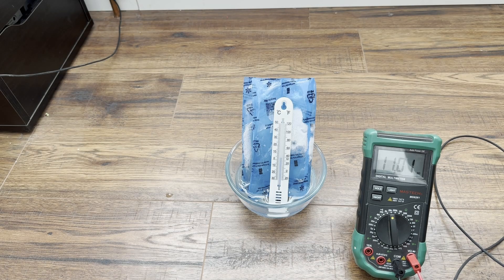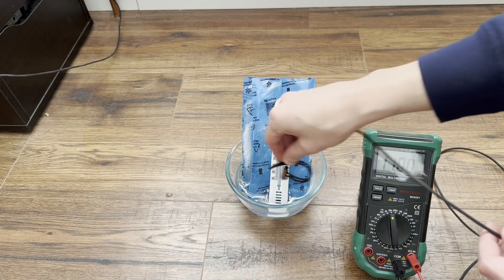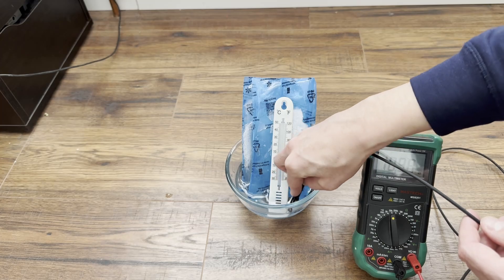Getting them up to that desired accuracy took a few passes and I'll talk you through those now. I started by checking that the NTC probes were actually outputting the expected resistance, and I accomplished that by using an ice bath and an actual thermometer. Once I was happy that the output matched my expectations, I proceeded to attach the NTC to one of the radiator tails.